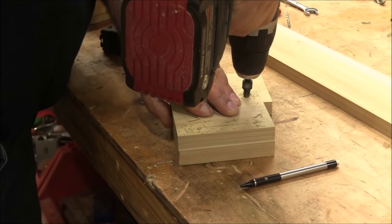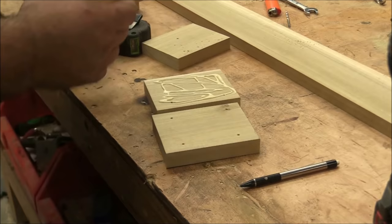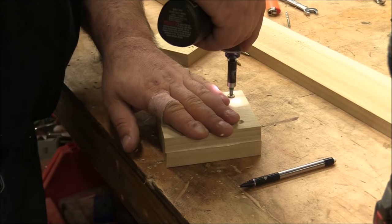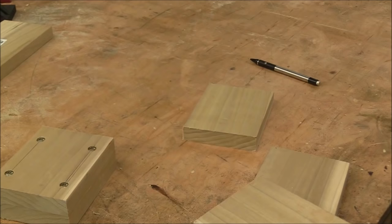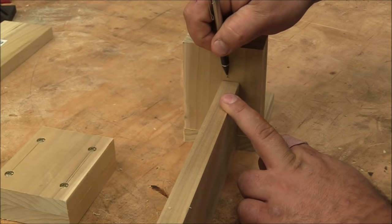After cutting six pieces — three for each side — I took two of those pieces and pre-drilled some holes and then added some glue. This is just going to help me line things up after the glue is on so it doesn't slide around. This is not a hundred percent necessary — you can just glue it or just screw it — but because I'm going to be using these a lot I want a little extra security. If you choose to just glue it, add a little glue, spread it around really nicely, line up the parts, add some weight, and leave it for a couple hours and you're good to go.